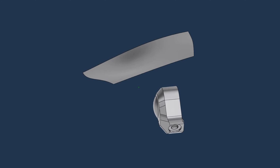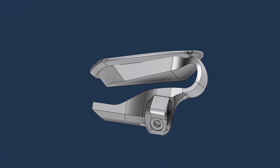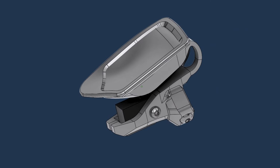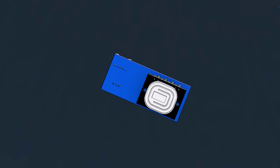Back in Fusion, I'm going to keep refining all of my parts. You can see on the front button I took in that record stylus look and tried to capture that feeling. Functionally, the actual top button surface will flex down and a little hammer here will hit that switch. The center area will hold the electronics package and all the ports to plug my buttons into.